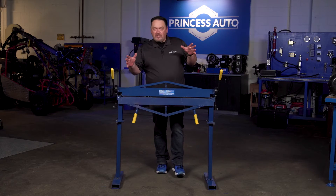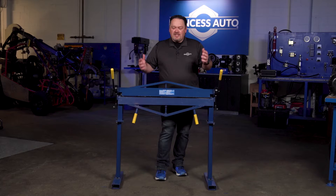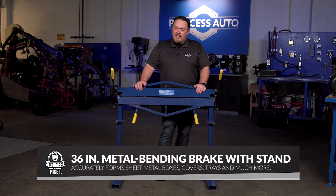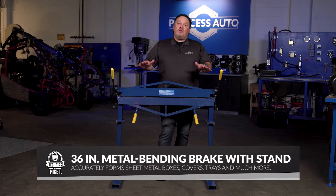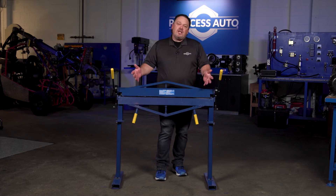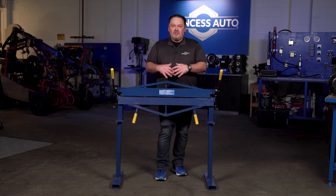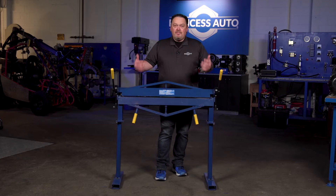So you're in the market for a sheet metal bender. Maybe you're trying to bend large sheets of steel, mild steel, maybe even some aluminum. Basically you're going to need a bender. Now they come in many, many sizes. In this case, we're talking about a 36 inch metal bender. It's not segmented, so it doesn't have teeth that you would take out and bend smaller components of that sheet, so you're going to use a full sheet. It's great for bending trays or sweep bins if you've got some around the shop.